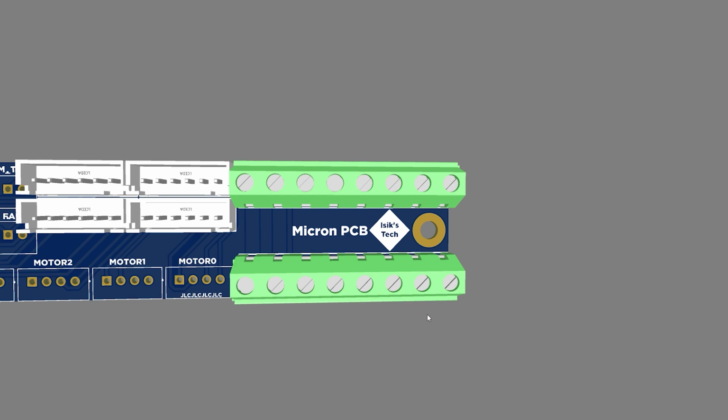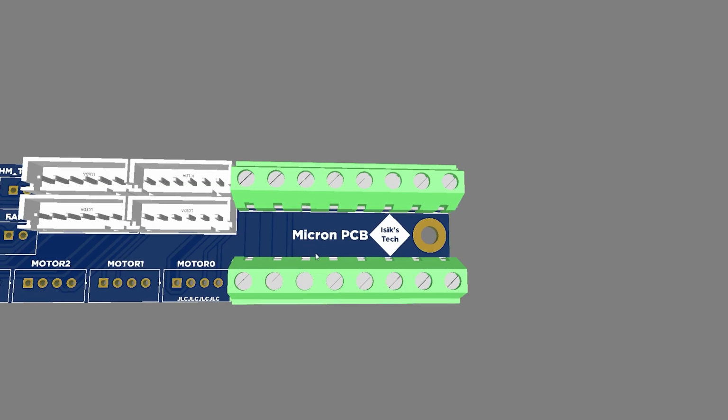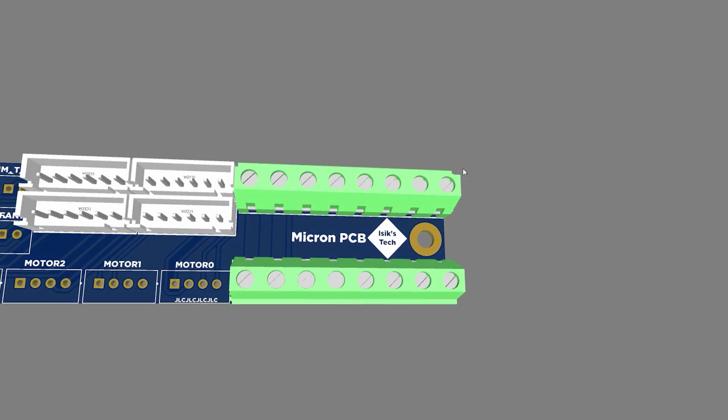And there are these screw terminals, again for the same thing, so connect the 24 volt and ground onto the power supply here, for example, or here, and then have a pair of wires running to the top electronics chamber using the same slots in the extrusions, and have the 2 pairs here for the bed heater as well, of course. So just run the 24 volts to the top.